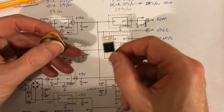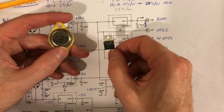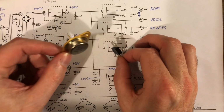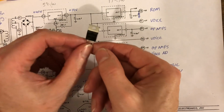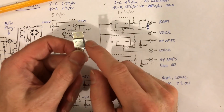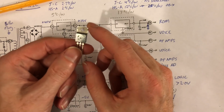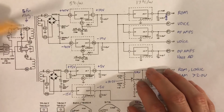the more modern equipment is having less and less power requirements, because they're just built with components that require less power, which means there's less need to dissipate heat. So there's no need for these ones. And in fact, even the TO220 package is becoming obsolete now, slowly. The bigger manufacturers are stopping them and handing them over to the smaller manufacturers. So even these are starting to get rarer. Anyway, all right, so let's move on to the important stuff.